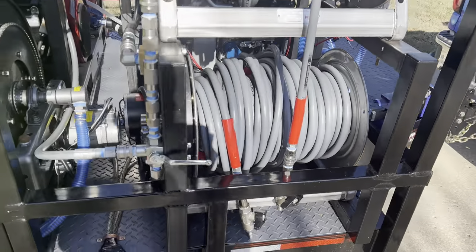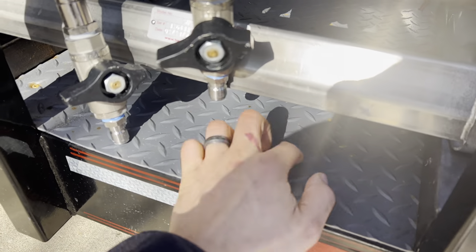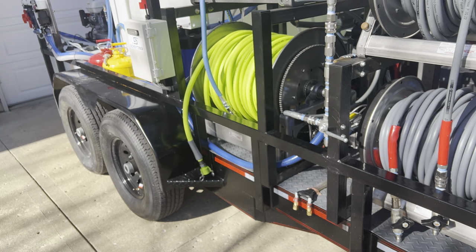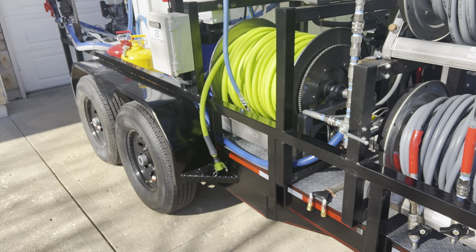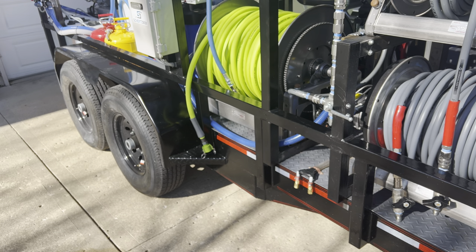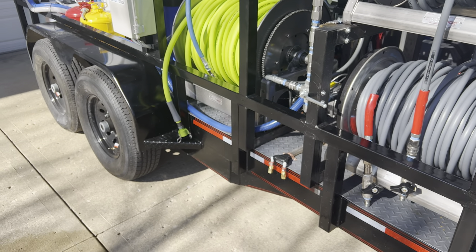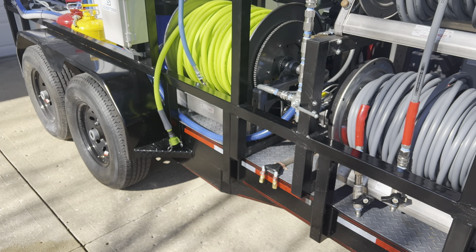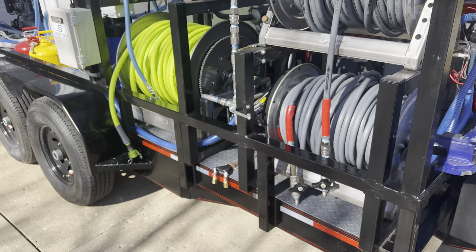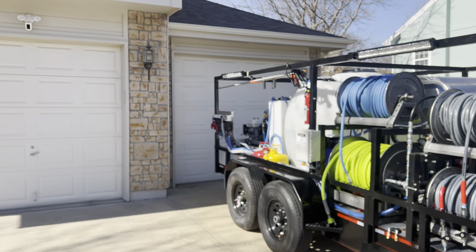The flooring on this is called G Flooring — it's a chemical-resistant flooring where rust literally just wipes away. I prefer this over painting the wood decks; it lasts much longer, is easier to clean and maintain, and you won't get paint chipping or chemicals reacting with paint. You lay it down, let it expand with warmth, cut it to shape, bolt it down, screw it down — and that's it.